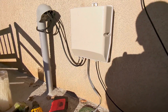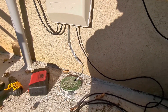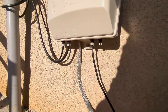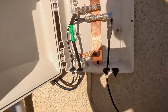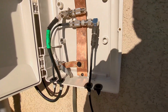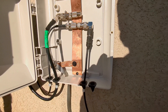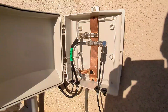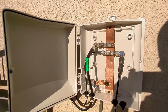There you have it — I think that turned out pretty nice. Tinned copper braid down to the ground rod and up into the box, cables zip tied onto the little tabs through the grommets. I have my second coax I need to run up through the attic. My intention is to use the LMR 400 for HF radio and the LMR 240 for VHF and UHF radio. Pretty good for doing something on the cheap, which is what most ham radio operators are interested in.